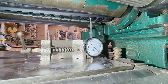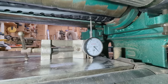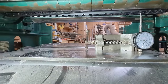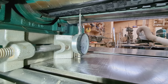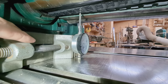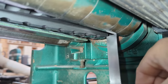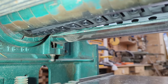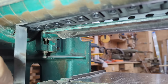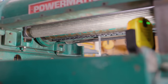Something I didn't do the last time I changed the cutter head out was really try to tune all the other elements in the planer — the chip breaker, the pressure bar, and the two rollers. The first thing I did was figure out if the table was parallel to the cutter head. It's a little tricky because this isn't a straight knife cutter head, so what do you measure against as far as where the blades are? I decided the teeth at each end of the cutter head are parallel — I'm not sure if that's true, but it seemed like it was and I wanted it to be. So I measured against those to check the parallelness of the table, and it seemed like the drive side was a little bit low.